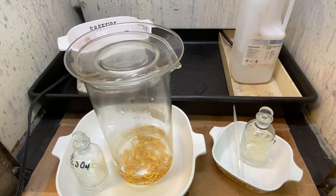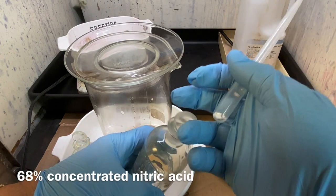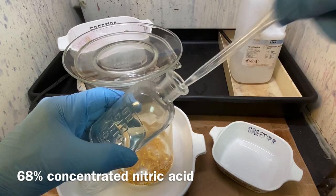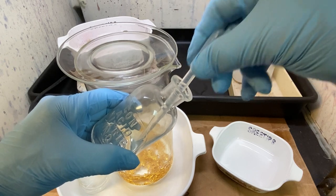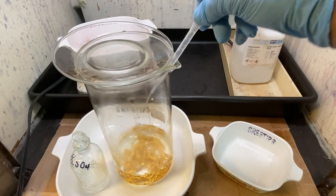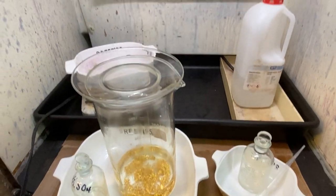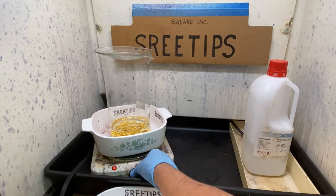Now what I'm going to do is start adding small doses of nitric acid. I've already got the hydrochloric in there. I just added sulfuric to take care of any lead that might be present. I'm going to add some squirts of concentrated nitric acid here and we'll start re-dissolving these gold flakes that we created in our little water pot earlier. That's about 15 milliliters of nitric acid — that should do it to get us started. We'll put this up on the heat and start dissolving our gold for repurification.